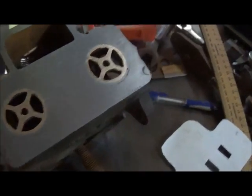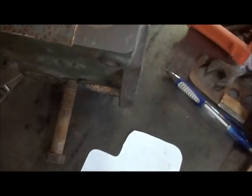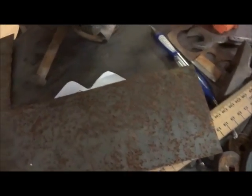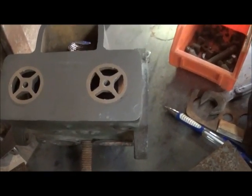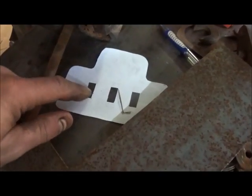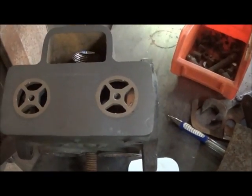What I've got here — I wish I had some cold roll steel; I've got hot roll, which is just a little bit dirty, so we'll have to get it cleaned up. It's just a scrap piece of metal and it's going to be just wide enough to make the plate we want. It's not 16 gauge — it's a little bit thicker, probably 14 gauge maybe. We're going to trace our plate out, cut it out on the bandsaw, then drill the holes for the slots and dress them out with a file.